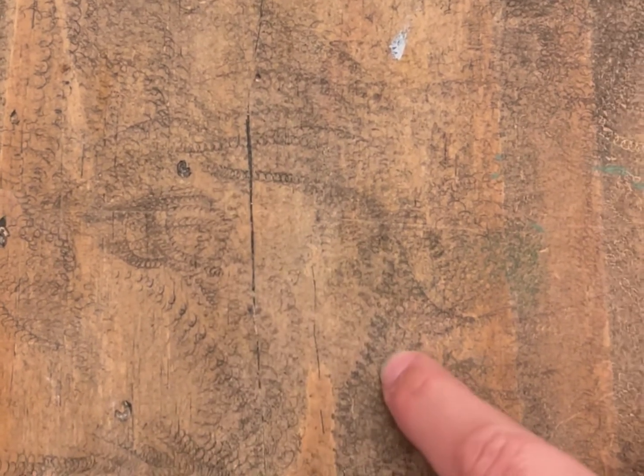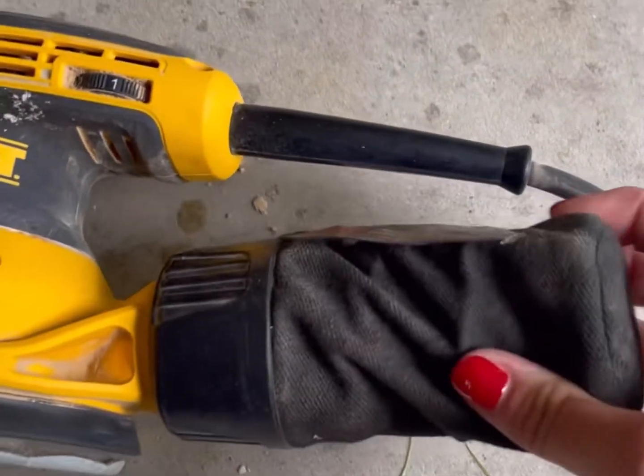To give you a visual of what I mean about holding the sander down too hard or operating it at a higher speed — this was an earlier project, our dining room table, and I still love it but I honestly need to re-sand it. See these squiggly lines? That's from the orbital sander — from me pressing too hard and running it at a higher speed. Those marks show up once you start to stain. That's why it's important to use lower grits to level first, then finish with 220.